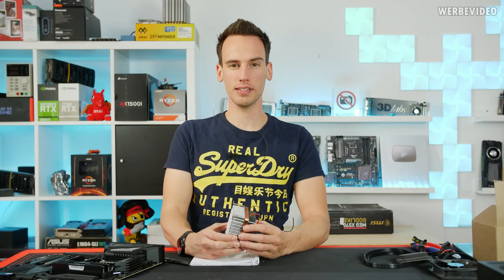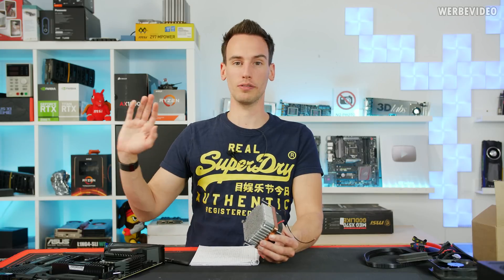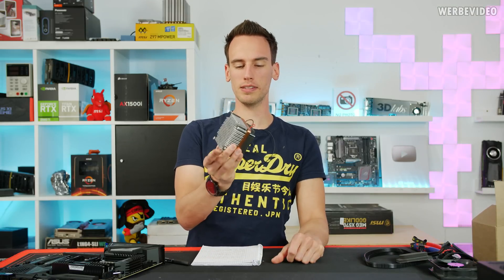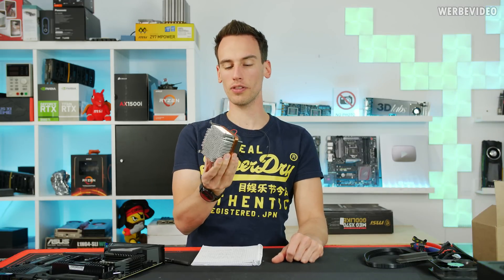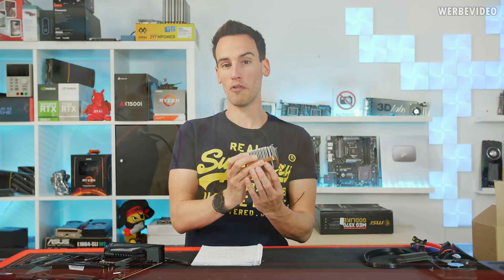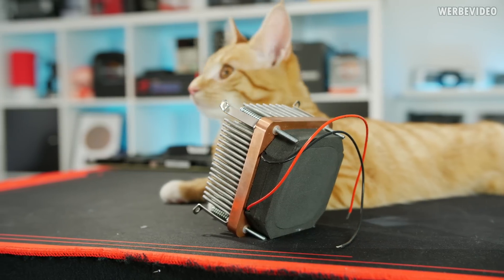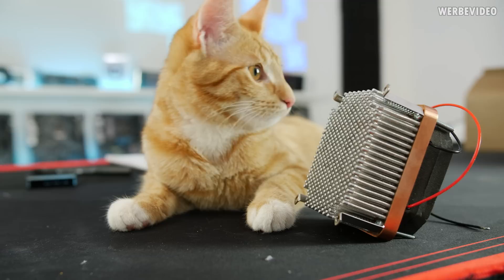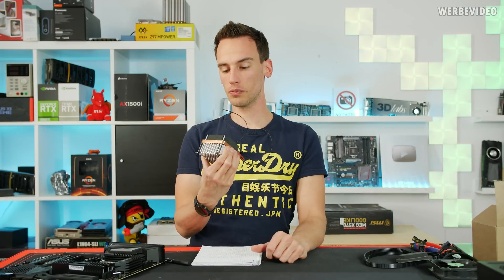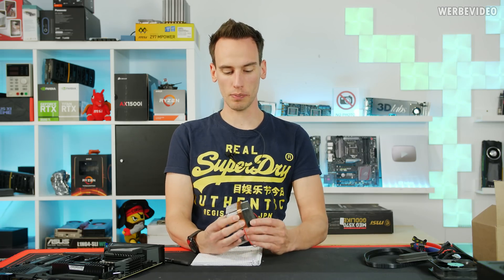Hi and welcome back to a new video. I recently visited my parents in the south area of Germany where I'm originally from, and where I still store a lot of my old hardware. Going through my very old stuff, I found a CPU cooling unit from Swiftech called the MCX 4000T — a Peltier TEC cooler from the year 2001, sitting in its box for many years, never used. I thought maybe it's finally time to try this on a recent Ryzen 3000 CPU. Back in 2001, Ryzen 3000 or socket AM4 didn't exist; this was made for the first Pentium 4, a completely different socket, so we'll have to make our own mounting to fit it onto socket AM4.